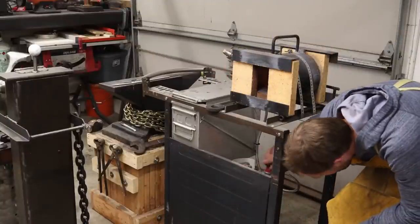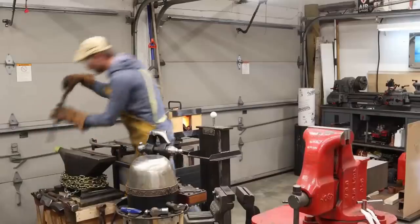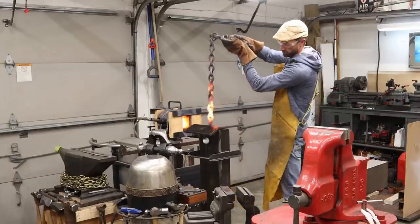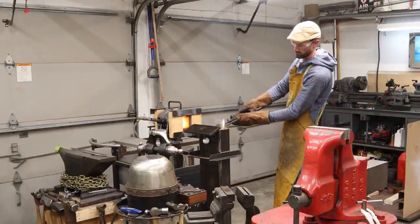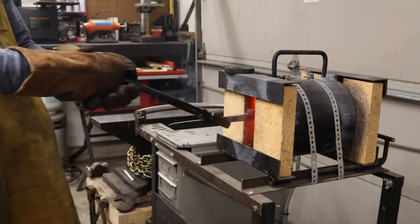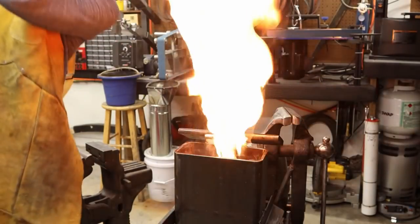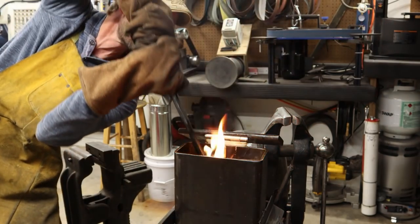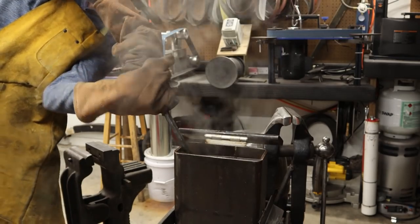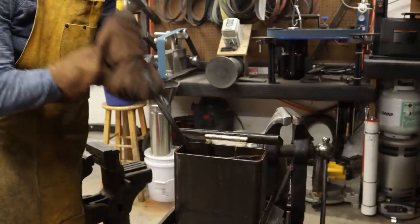I'm going to move right into heat treatment. First I'm going to light up the forge and throw my chain in there — I use this chain to preheat my oil. I've got a nice long tank so the chain heats the oil all the way to the bottom. I'm going to pass this blade through from front to back continually. This process takes a good five to eight minutes until I get a nice even heat, and then we go in for the quench. I'm doing an intermittent quench to get that springiness back into the steel. Right after the quench I throw it in the kitchen oven at 425°F for two hours to temper it back to a nice springy state.